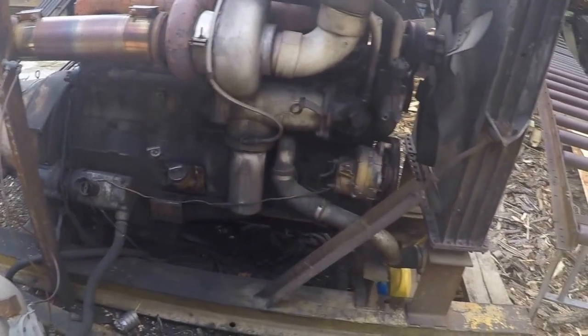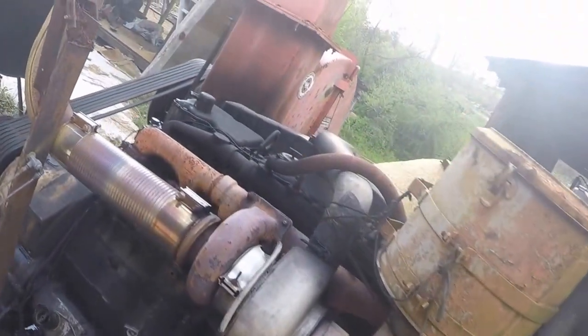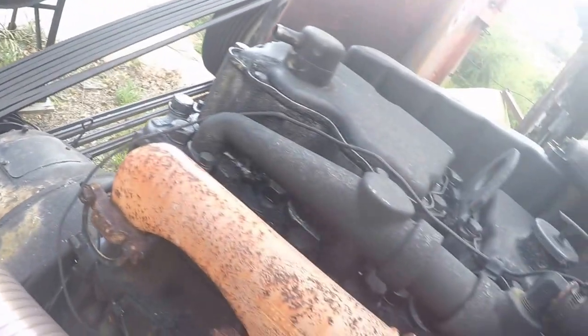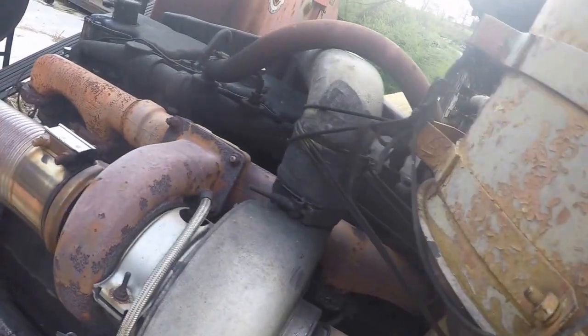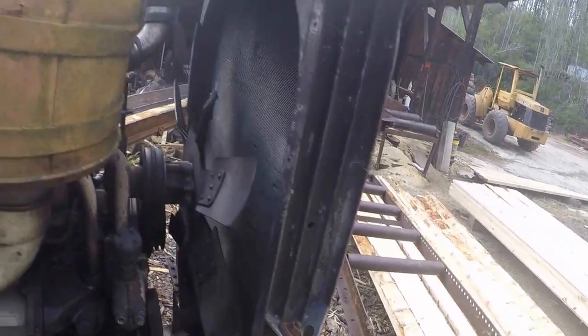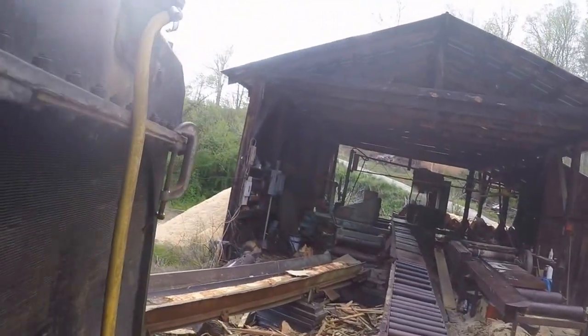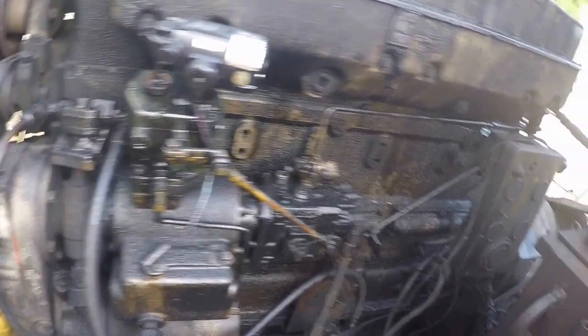We had a little mishap this morning. This motor here decided today was its day to die — it blew up. I was over there sawing away and I looked over here and you couldn't see nothing for the white smoke. It just went everywhere. I'm not going to spend more money on this thing. I've never liked this motor — I've rebuilt it one time and it's always run hot. It just ain't happy sitting here in one spot. I just paid, I think it was $385, for this governor right here. And when it decided to die this morning, it sprayed oil all over the side of the motor, all over the side of the chipper. So that's pretty much it for that old motor.